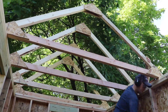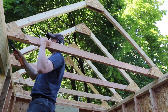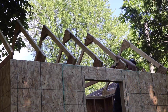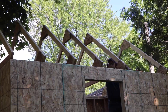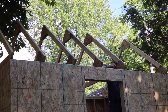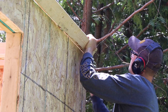These rafters are immensely satisfying to put up. My good neighbor Mike — who doesn't want to be on camera — lent me this massive ladder which extended to like 24 feet, and it was really stable. I put on my outside rafters first because they should be nice and flush with the walls, remembering that your sheathing is going to make a nice seamless approach from top to bottom on the outside. Do those two first as accurately as you can — for me everything in the front had to be perfect. Then I spaced out the rest of the rafters one by one, using a common reference point: put it up there, make sure I've got 24 inches on one side, tack one nail, do the other side, tack it, then shimmy and adjust as needed, all the way across.